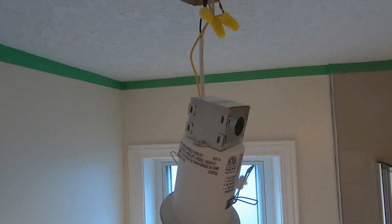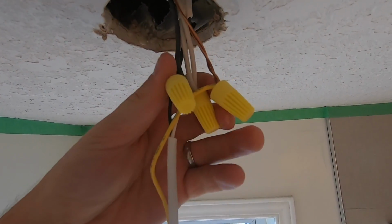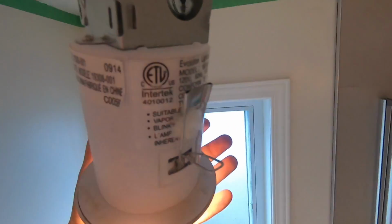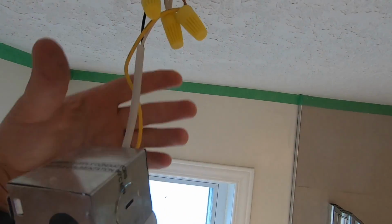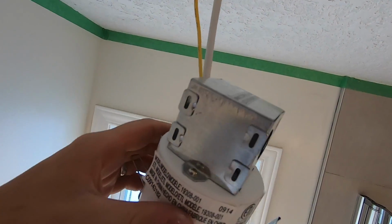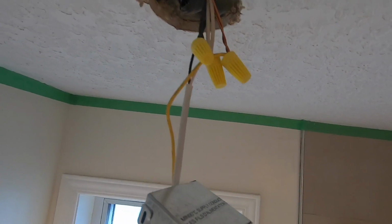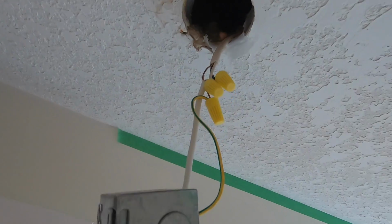This pot light, and I've just put the electrical connection, just plugged it up in the ceiling. I don't really see much insulation above it, which isn't good. This connection's supposed to be inside here, and there should be a wire clip. So that's sharp, could cut that, and then this is just in the ceiling. I imagine the other one's the same. Other side's the same.